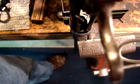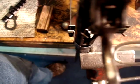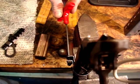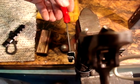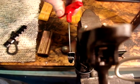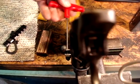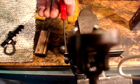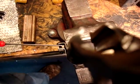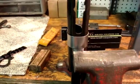You get a little bit of tension on it, and I'm basically just tightening it, putting tension with two fingers, for the most part just my thumb and my index finger. So I'm not really torquing on it. I don't want to torque on it real tight at this time. I want the band to start to form to the receiver. Once it gets a little snug, we still have at least a good 3/8 of an inch gap there. Then I'm going to start to form it a little bit with my block of wood.